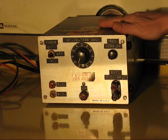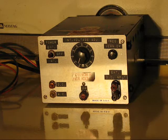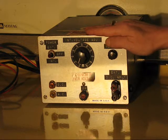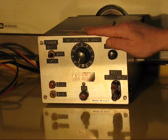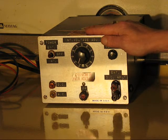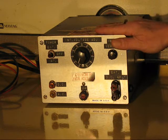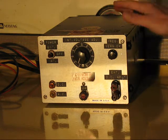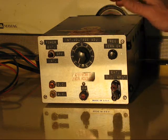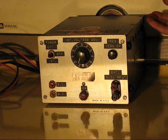It also uses a cascade tripler, which is a sort of rectifier capacitor circuit that takes the AC out of the flyback transformer, which in this case is about 8,000 volts, maybe a little more, and rectifies it into direct current, DC, and also triples the voltage value. Now, of course, that comes at a cost. There's a current limitation with it, but it does get you the voltage. The tripler in there was taken from a color TV, I think a Trinitron. A very well made one.